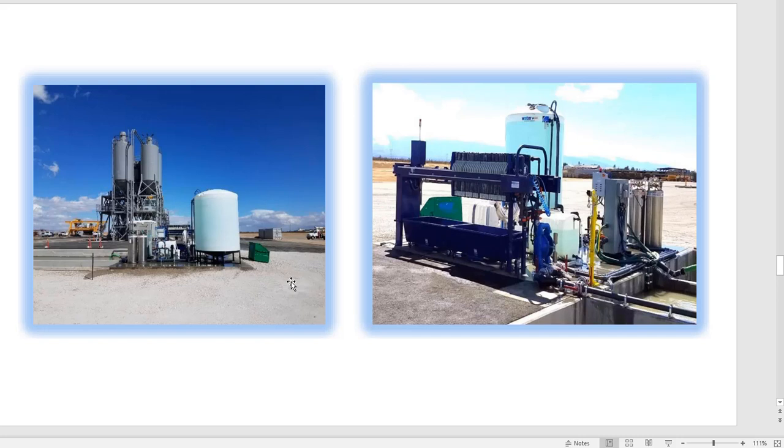This is another option. One of the problems we've got is if we keep all the material out of the pit and we just have a whole bunch of cement and water but no materials, we can now handle the materials easier. The reason you want to do that is because each fine and little piece of cement is what's really holding all the water in that material. So we've been working real hard on trying to make this an easy and inexpensive way of doing this and saving some time and labor.